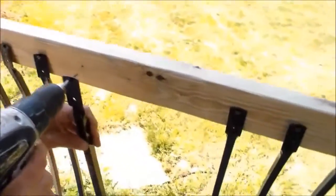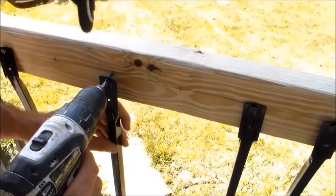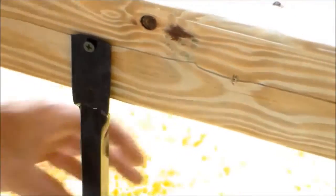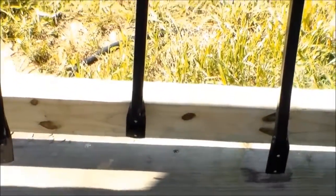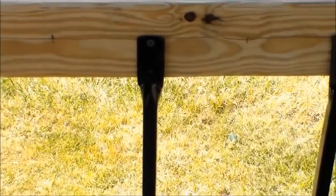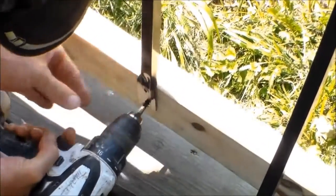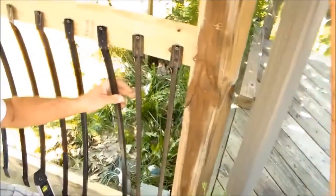We're going to use one straight one here, although we are installing a curved baluster, just to show the difference. They're exactly the same up to now, but the straight baluster will plumb itself if there's no wind. And in that case, on a windless afternoon, it hangs vertical. It just blew a little bit right about there. There you go. All you've got to do is that. You don't even need a level. But the curved ones, they do tend to hang back. Okay, so they're hanging free.